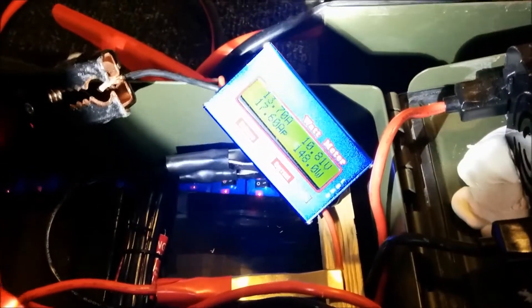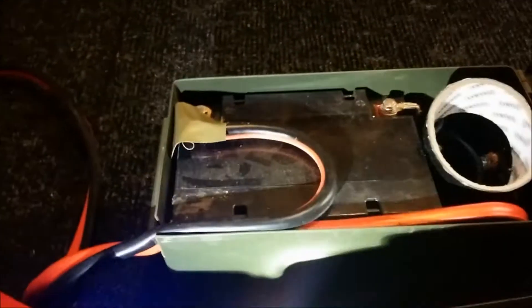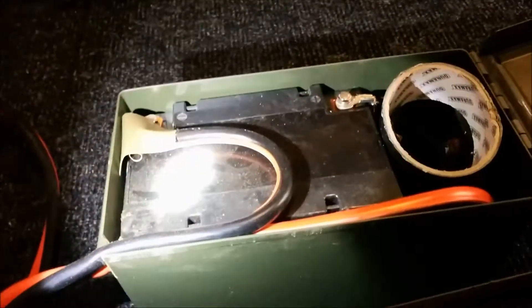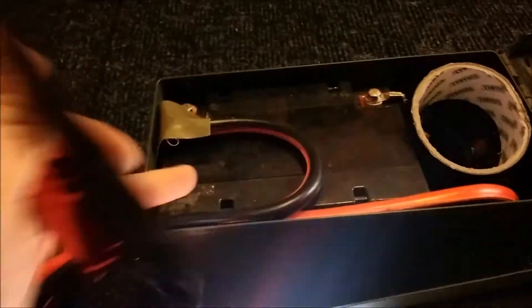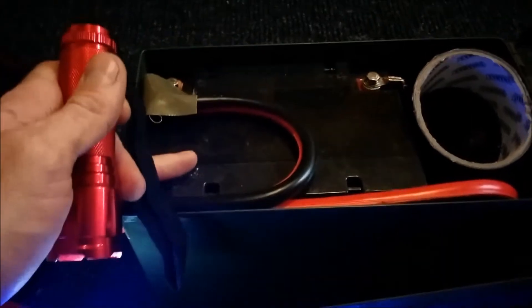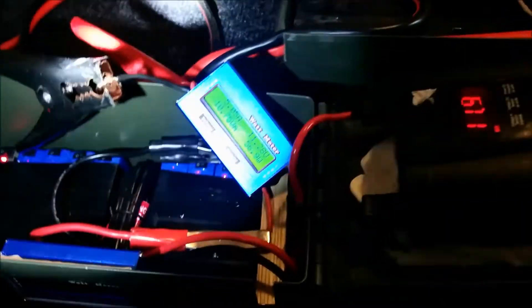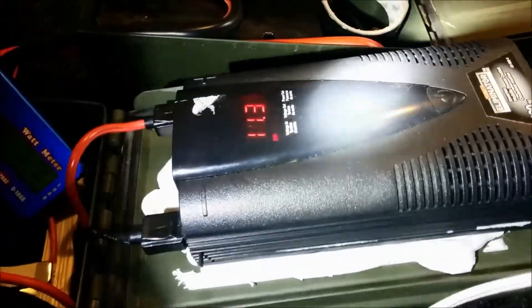That's the difference — this is a rated 35 amp hour battery. I'll minimize the screen so it takes less power. This battery was charged; it's about a year and a half old and still has pretty much full capacity. But to get the rest of the power I'd have to let it go down to 10 volts, and I'd probably end up with something like 16 to 18 amp hours, but the battery still wouldn't be completely dead.